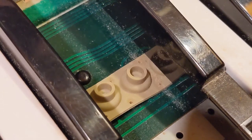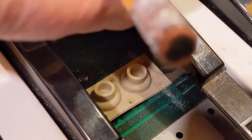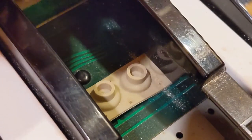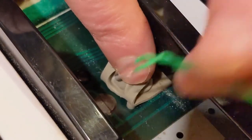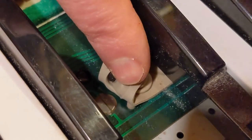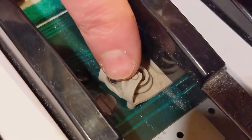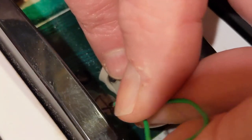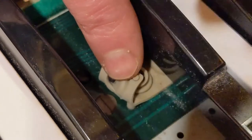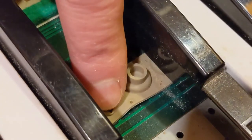Here's what I want you to see — two things. I got out an eraser and cleaned the contacts, and it just immediately started turning black like that. So I cleaned them and hit them with alcohol again. I've got basically a jumper wire here. There's the contact — it looks like a flat head screw, which is interesting; I was expecting little interlocking S's. That's my key. So the key circuitry works — that is shorting the key. And now, if I put this back on, that works too.